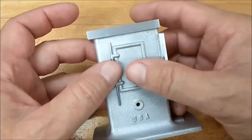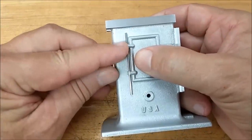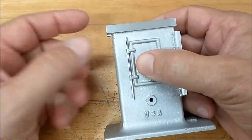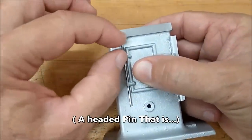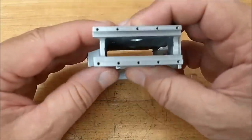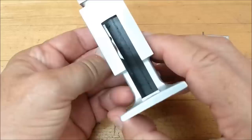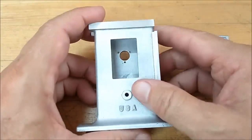I had considered, and I know some of you guys are saying, well, why don't you do it this way? Well, let me say for a second, I had considered just attaching a large lug in the center, screwing it down, peening it however, and then using one long pin. Now the problem then becomes you can't get the pin in because the pinned length is longer than this length right here, right there. And you probably could stick it in from the bottom, but I don't know about that. I'm just going to make a couple of little horseshoes that come up from the bottom, screw in, and on the inside I'm going to trust that I have at least 2 millimeters worth of clearance to anything moving around in there. If I don't, well then it's not going to end well.